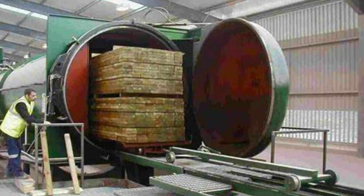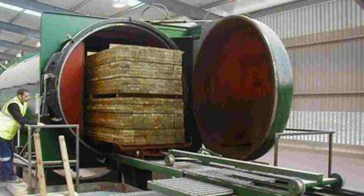Pressure-treated wood, on the other hand — what I call wet pressure-treated wood — you'll know it because you pick it up and it is wet to the touch. It's heavy. It's probably so wet that if you smack it with a hammer, it splashes. It's very saturated. It's way more wet than any other framing material you would buy, and that's from the pressure-treating process — it's submerged in a submarine tank-looking pressure cooker that forces the chemical treatment inside the wood. That's how they get the treatment to penetrate inside the grain.